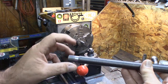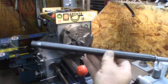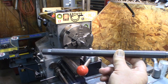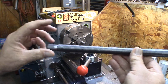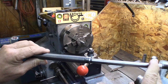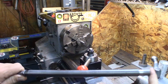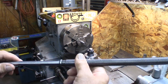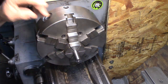I think what I'm going to do is turn this end first. The piece of material I'm using is 4140 pre-hardened three-quarter ground rod. I checked it as a shaft on my balancer wheels - just a couple tenths if anything; there's no bend in it, it's nice and straight. I'll turn this end first, probably do the other end last so I have a lot of stock. I can put this end in the chuck, put the center on the other, and have plenty of room for threading on each end. I've got the stock in the six-jaw; I've checked the runout and it's just a few tenths - very minimal. I've already faced and center drilled each end.